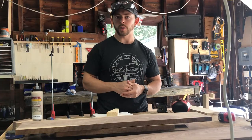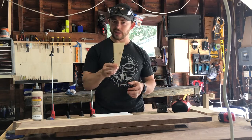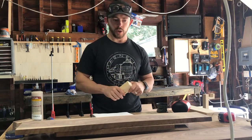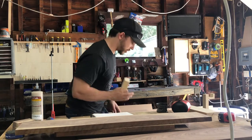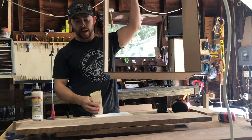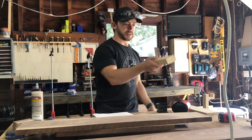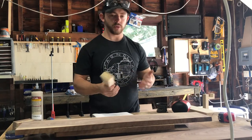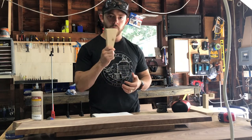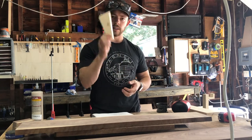While the doors are gluing up, I'm going to start working on the legs for the cabinet. I've decided on just a slight taper, sticking with the mid-century modern vibe, and this is just out of some scrap 2x material. Just to give you an idea of what that's going to look like on the cabinet. I've got my material laid out ready to go — I'm going to laminate some of the boards I already have milled up, plane them down to one and a half inches thick, and then take them to my crosscut sled to cut the taper.